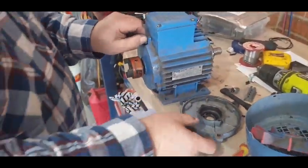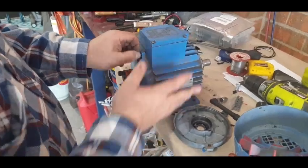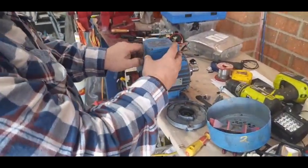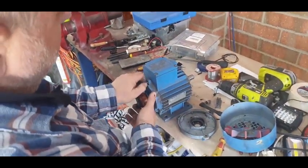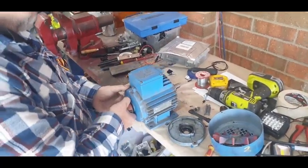We've taken our three bolts out. The covers are also made to fit either end — so if you need to turn the shaft around, you can turn it around that end. The whole body and everything's the same. The only thing you're going to find is where the motor cover is on the top — you can't interchange that around. But the shaft end-to-end you can change. They're all the same, the bolts.